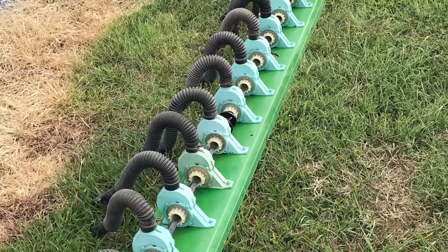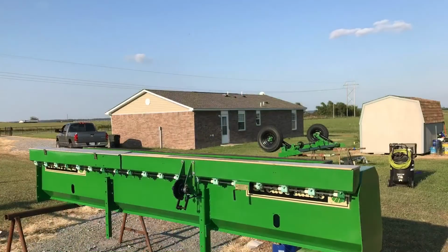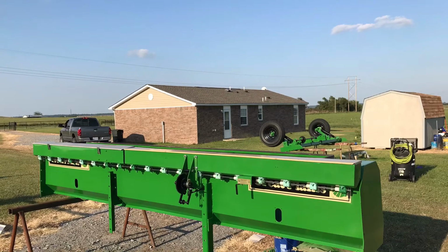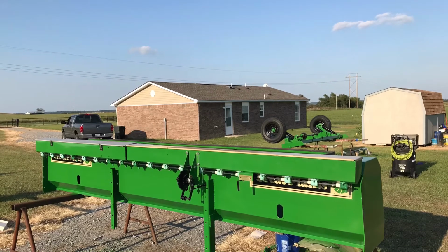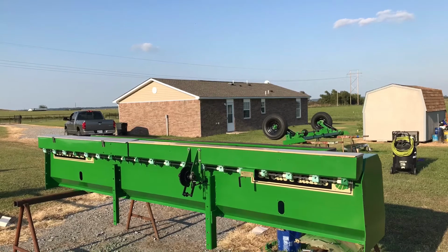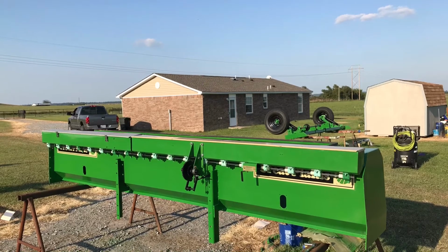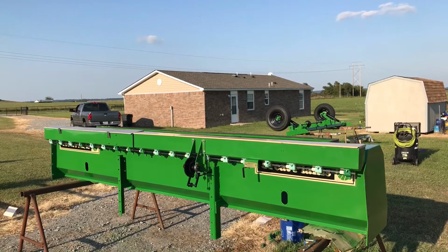I went ahead and sanded it all down and repainted the rod black. This is the main box, all painted. It's almost ready to mount on the frame. I had to replace a few of the seed cups on the small seed box because they were actually broken. A few of them broke when I was removing the bolts to get them out.